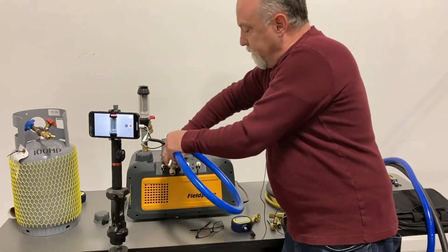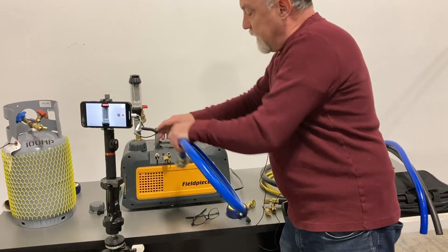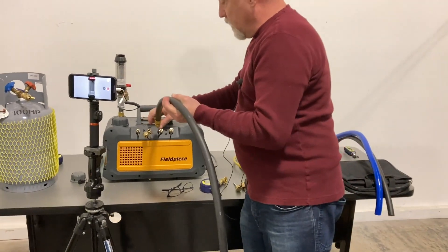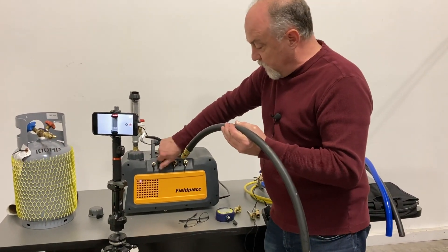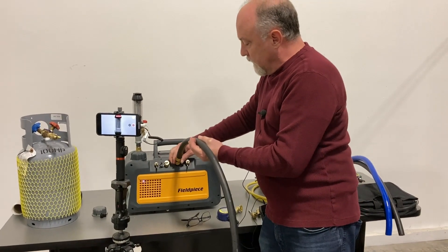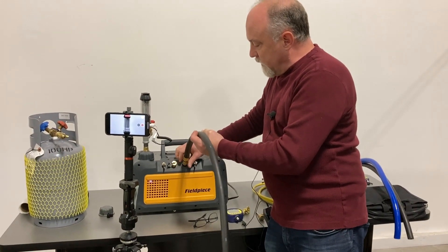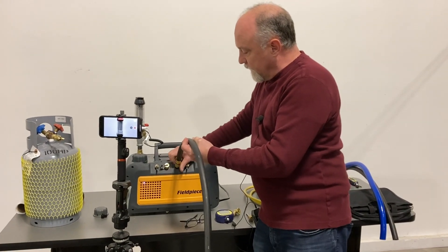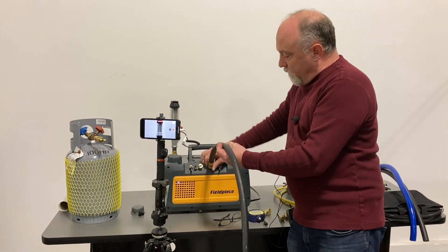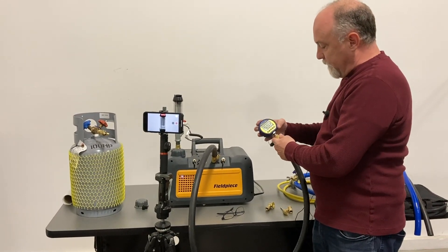The pump will pull down to about 15 microns, so the goal of whatever we're doing here is to take all the work being done at the pump and move it to the far end of the hose. These are six-foot hoses — a little bit longer than most guys want to work with, but for commercial work some people still want a six-foot hose. When it comes to performance here, let's get it good and snug and take a look at what actually happens.